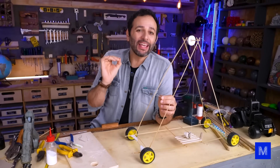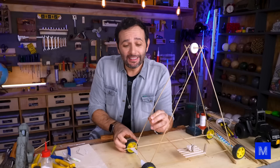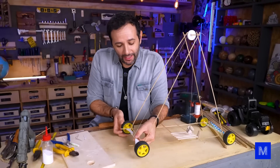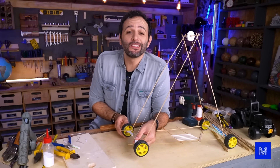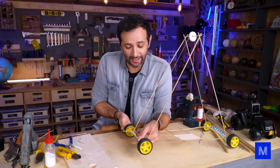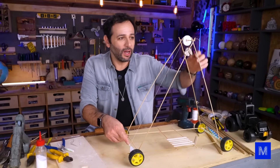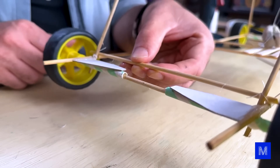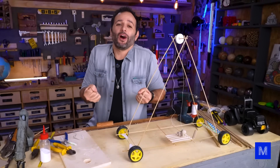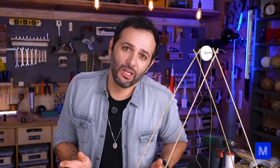Here's the trick — how do we wind it up? There's a loop at the end of the string tied to the rock. This loop attaches to the wire I added, and then we start turning the wheel. As I turn the wheel, the rock rises — it's storing gravitational potential energy. Once it's fully wound, the rock is up and the string is wrapped around the axle. When I let go, the string must detach at the end. If the string gets stuck it stops the car; if it detaches the car keeps going, picks up speed and keeps moving. We haven't tested it on the ground yet to see if the stone's force is really enough to pull the cart.